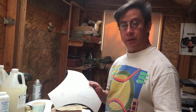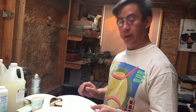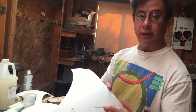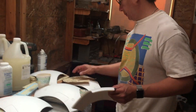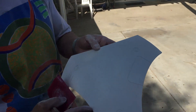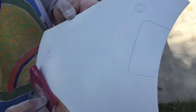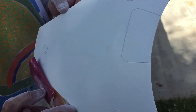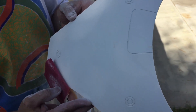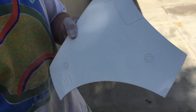Here's the panel after it's dried overnight. What I'm going to do is just sand it down and then show you the finish on the surface. So after about 15 minutes of sanding using 220 sandpaper, you'll see most of the lines are gone. I probably need to do another two coats of primer, let it sit for a day, and maybe another 10-15 minutes of sanding. And this panel will be completely done.